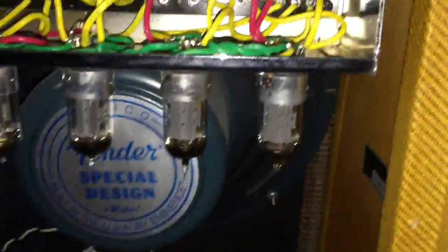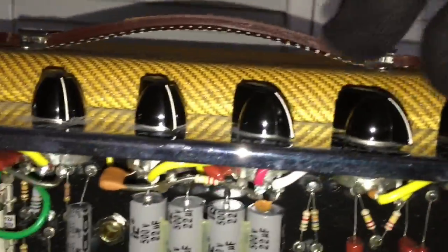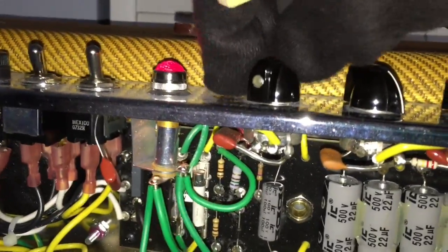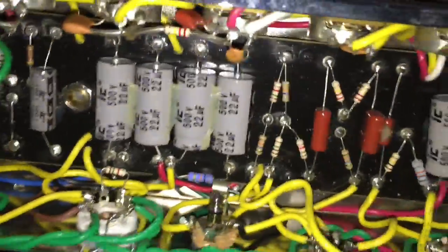Let me just record the speaker sound of it. These are the other ones that are normal. For the power and the two rectifier tubes, two preamps — they're okay. Two preamps are bad. All the wiring looks okay. I had everything full up, and now I'm putting everything back to midnight like I like it. This bright channel is ridiculous. Problem solved.